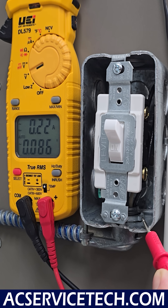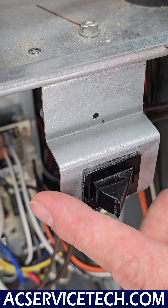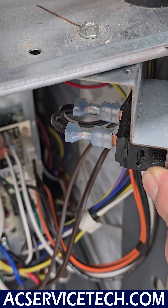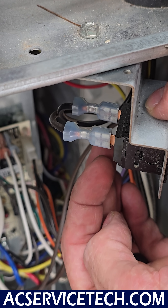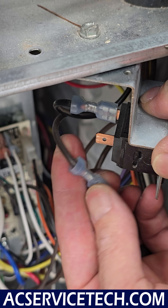We need to go ahead and see why or where that fault is located. We remove this one screw from the top right here and turn this so we can see it. We can see that the emergency power switch has been turned to the off position. Our problem is between these two terminals and that switch over there in the front, and this wire is good.